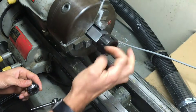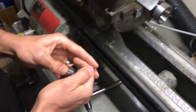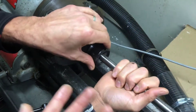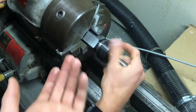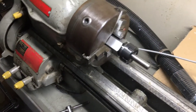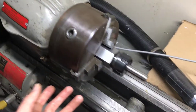However, the centering of the material is not going to be as good as if you had a direct collet adapter, because the run-out — or the lack of concentricity — is still variable based on whatever the run-out is on the jaws of your three-jaw chuck. Three-jaw chucks are notorious for being quick to set up but not having good run-out; they can be a little bit off, versus collet chucks which will be better.